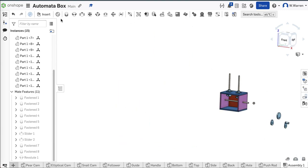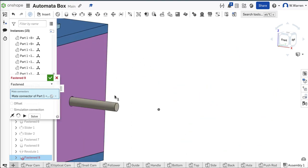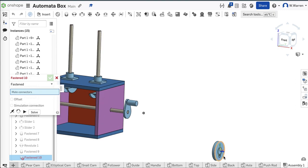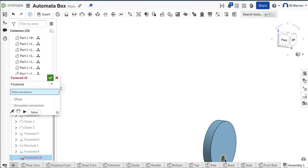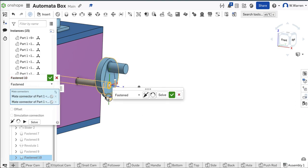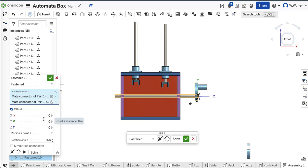All I have to do is my handle and cams now. Handle gets fastened — when it rotates the rod does too. I want that outer edge right about here. Fasten. We've got to change the color, make it more beautiful. Then I need to put that outer edge of that hole on this rod and offset it. I did 0.5 inches before. Let's look right at the front — my objective is to get that cam right under the follower foot. On the Z axis I'll go — that's 1.5 inches to this edge, so about negative 3. Wrong way — let's try negative 3.